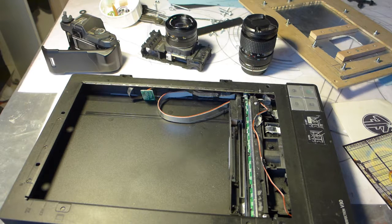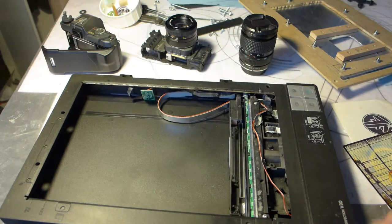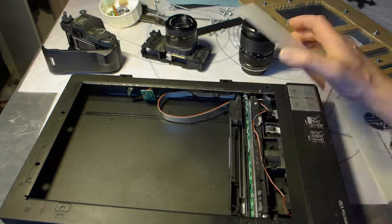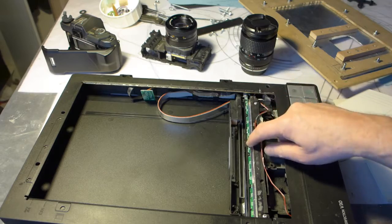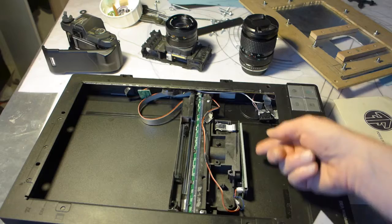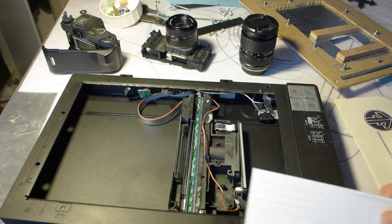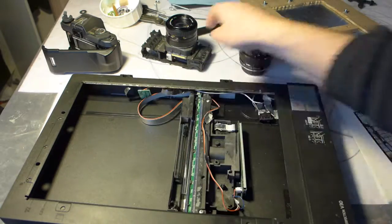Yeah, you do this and this and then it works, and it kinda doesn't. First of all, how does a scanner work? Well, a scanner usually has a glass plate here. And for instance, you take a picture, you put it on there and you say scan, you turn it on, connect it to a computer. Then there is a light that shines up towards the image, reflects, goes through a couple of mirrors there, and then there is a lens there, and it goes to this sensor and is then automatically moved towards your computer and turned into an image, line by line by line by line by line.